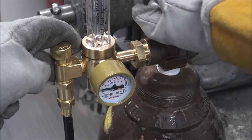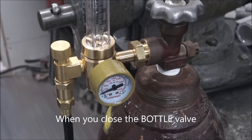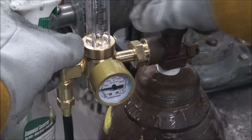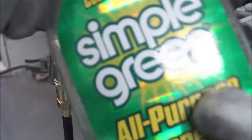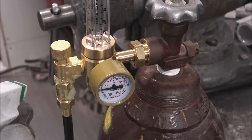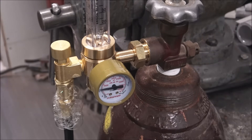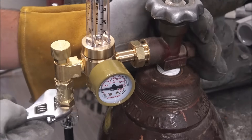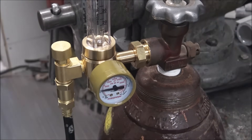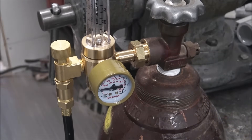If you have a bad leak it's easy to notice because the needle will drop. See how you can see that needle's slowly dropping? Check for leaks — open the bottle back up. Just use some soapy cleaner, like dish soap or Simple Green. You spray it, and see all those big bubbles? So you know there's a leak there, and you've got to tighten that down tighter. Always try to get in the habit of shutting your valve off when you're done welding so you don't waste argon.